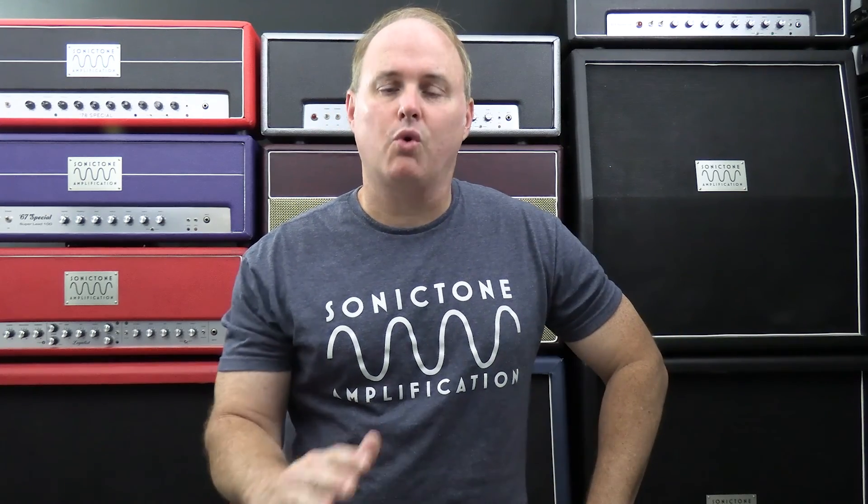From a high level broad sense, negative feedback is merely a tool in the toolbox to help us fine tune an amp towards the end of the line, usually around the power amp section of the circuit. What it does is if an amp is on the verge of instability, we can inject negative feedback to help calm the amp down and tighten it up. It extends and flattens the frequency response and makes it a smoother, more stable sounding amp.